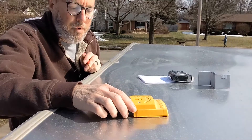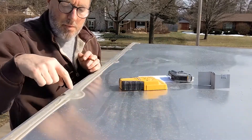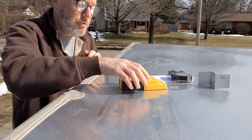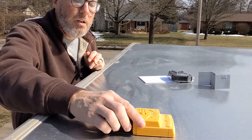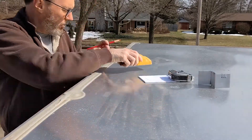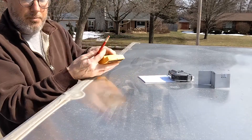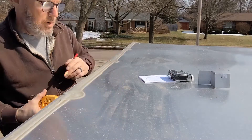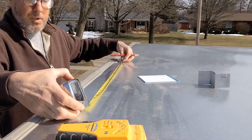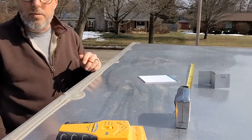Okay, so up on the roof, first thing we need to do is figure out where the cross members are — that's what we've got to mount to. I'm assuming they're where these screws are showing right here, and I just want to verify that. Yep, that is holding true. Those are 24 inches on center, so we're good there.